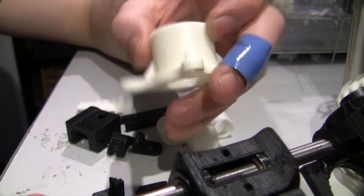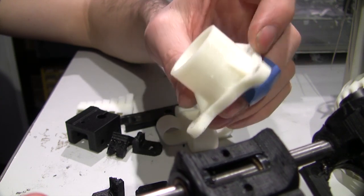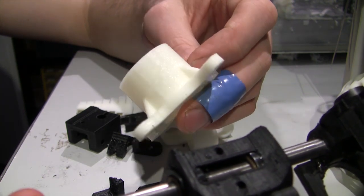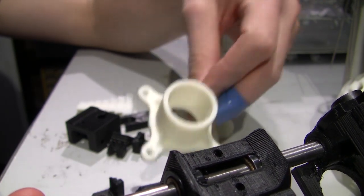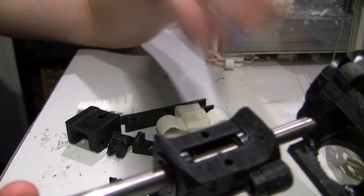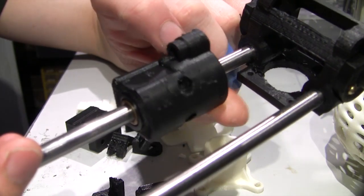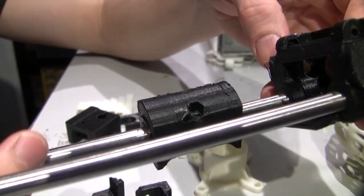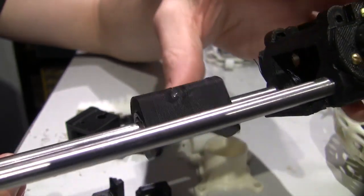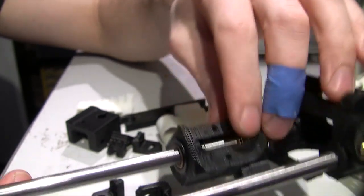So I reckon they set their extruders, because it was over extruding by almost 50% when I received it, and when I calibrated it was pushing out almost 150 millimeters instead of 100 millimeters when I said to extrude that. And I think that's half the reason they get blobbing, and it's also, I think, helps make sure it binds a little bit better, because it's extruding a lot more than it thinks and pushing it into the bed.